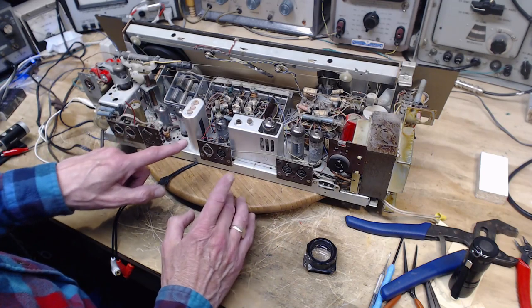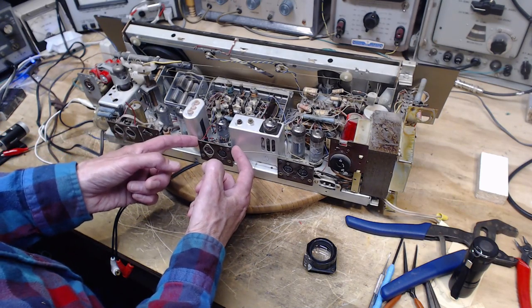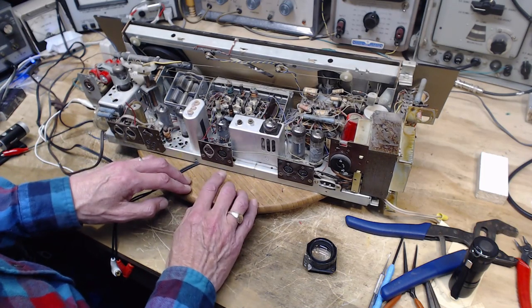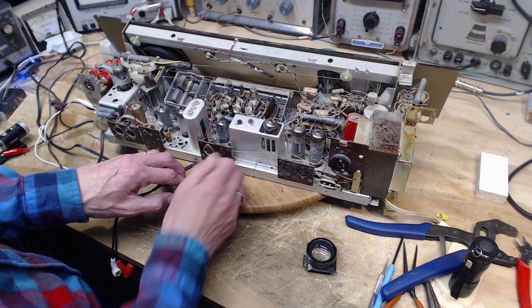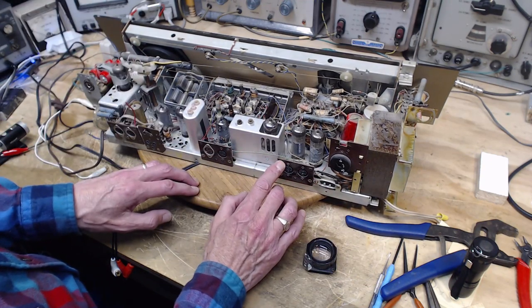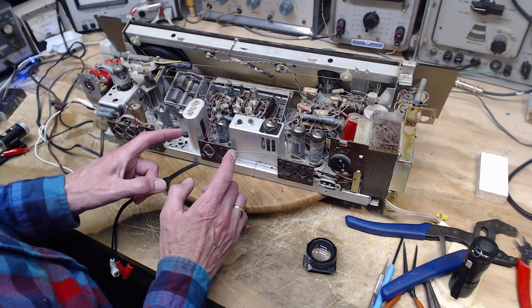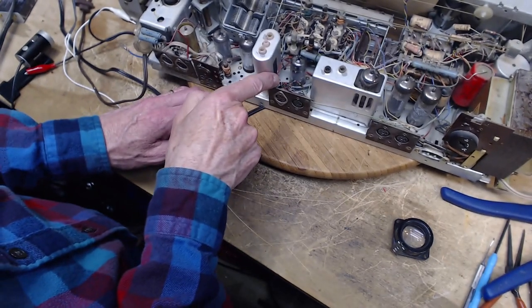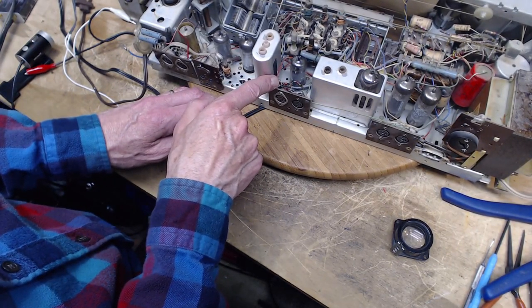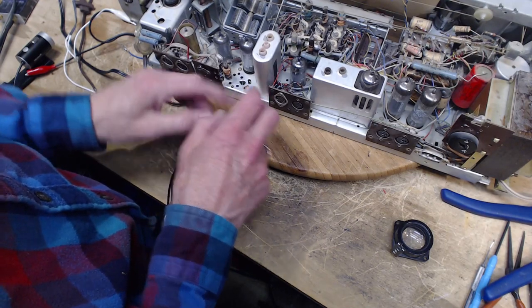There's two non-shielded wires. There's a red one here, you can see, and there's a green one over here, just like it. They come to these terminals. There's some handy terminals on this plate. The terminals don't go anywhere. They come out here for some reason. You could touch a probe here and make a measurement if you wanted. Don't know why you'd want. Same thing here. I think these are just handy dandy terminals. So they've brought the green and the red wire to these terminals, and then the green wire is attached to this resistor. And the red wire is attached to this resistor. That's an orange green. So what would that be? 3.3 megohms, I think, offhand. And then they go into the connector.